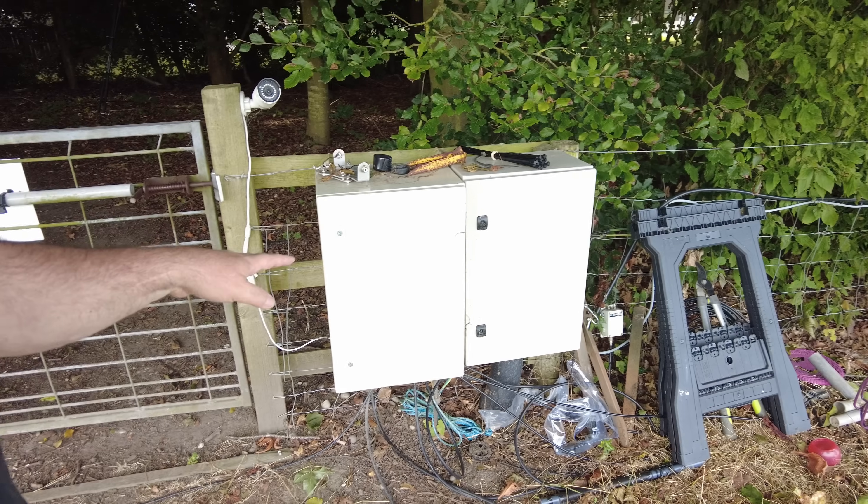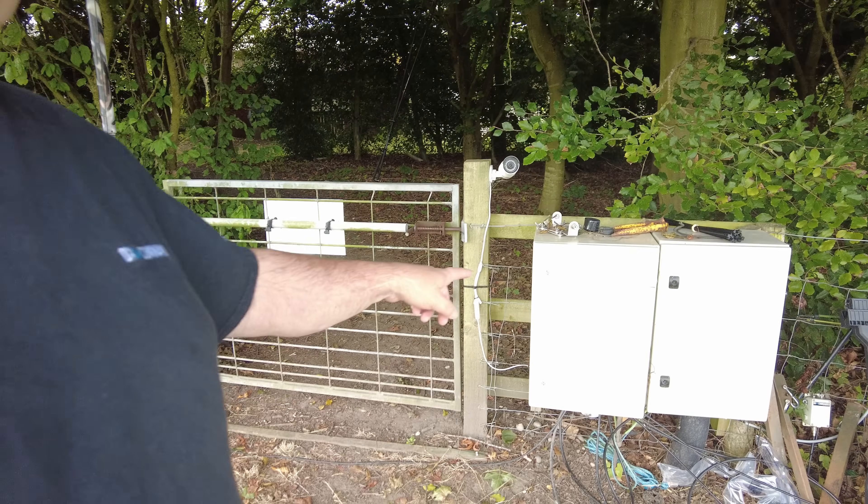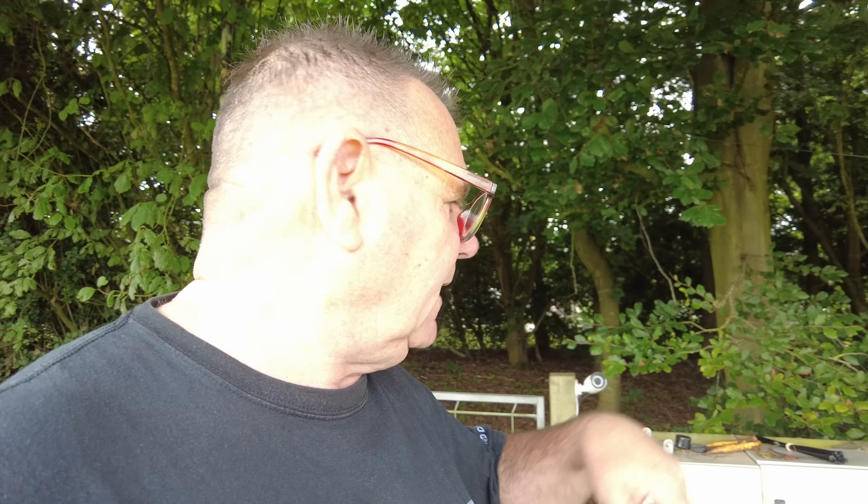I just want to check what's going on in here when it comes to grounding. Tom was telling me the other day that a couple of times he's been out in his field messing around with his antenna and he's got a static shock off the ground braid of the coax — the ground connector on the SO-239/PL-259. I never get that, and I believe we're grounded here. So I'm going to do some multimeter work and also make sure that cabinet number two on the left is grounded — it might not be. If so, I'll pop inside, get a ground strap, and connect the two cabinets together.